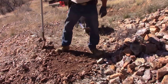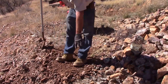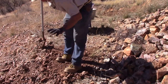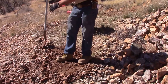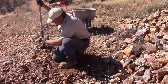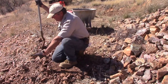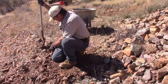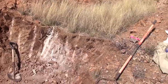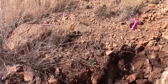Now the next wheelbarrow full of fairly fine material can go right here. And you'll be daylighting right about here. Dump your wheelbarrow so the little bit goes on top and the big rocks go over the edge. That way you'll have a little bit of fines to surface your road with while the big stuff is out of your way. Here's the working face, all cleaned up and ready to go. The time is just before 2 in the afternoon, and I've placed markers where the current face is.